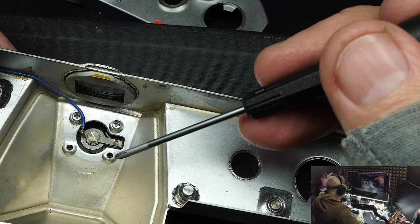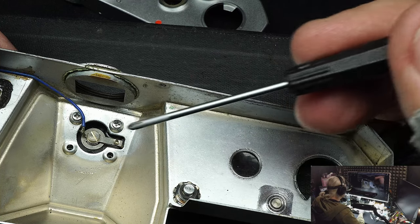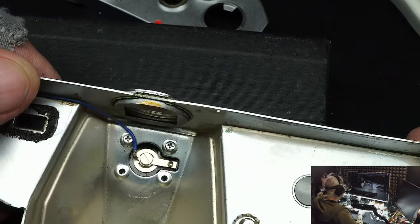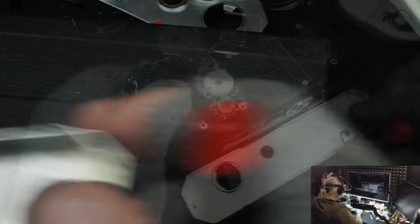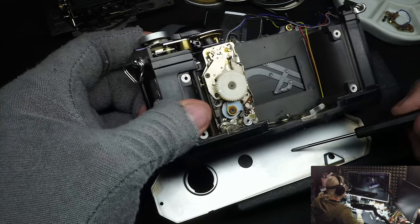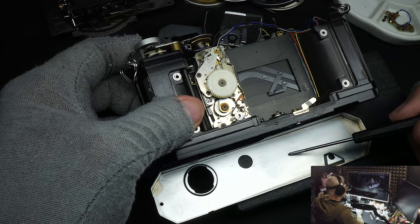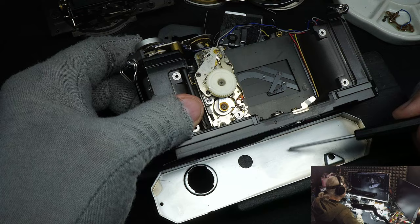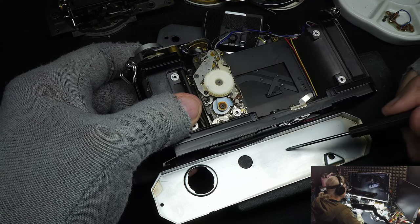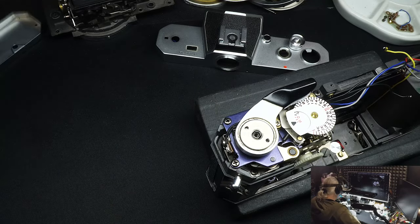You're not always that lucky — a camera can lock up for a hundred different reasons. But when I saw the two screws missing and the customer told me the camera was locked up, I knew immediately those screws were the cause. I started disassembling and hunting for them. One screw was lying in the bottom cover tray. As long as the customer held the camera upright it wasn't going to cause trouble, which simplified things — I only had one screw left to find.